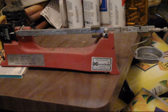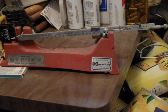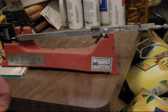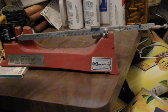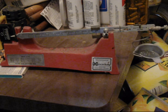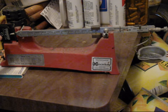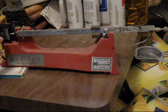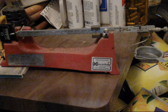Then I usually do two more just to be sure. One advantage to the Autodisc powder measure is the adjustment does not drift — it is a fixed cavity in a plastic disc, so unlike the RCBS Uniflow, it won't work loose; there is no adjustment. So I throw another charge and check that. You can see how far it swings past the zero mark. After using your scale for a while, you'll learn how far it swings so that you will know it will come back to zero.